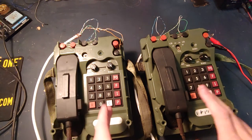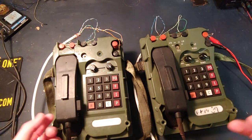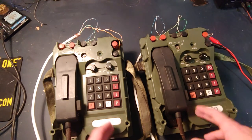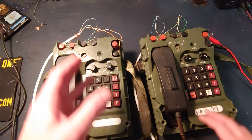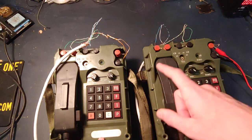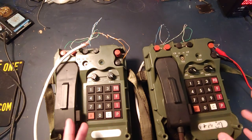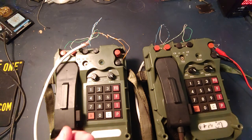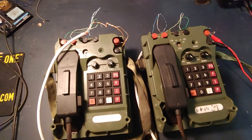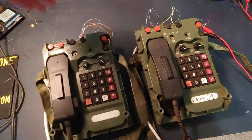These phones will go up to 1,000 feet, which is their normal or maximum range. On eBay they have spools of wire that run about 1,000 feet — that's actually what these were designed for. I would much rather use Ethernet because it gives me a 4-pair and I can use a pair for 12-volt DC. At 1,000 feet, I don't think a DC power supply would travel that far on Ethernet, so I would probably need my remote phone on a separate battery. But it's completely doable. If somebody wants to hook this up in a barn or an off-site room, a 12-volt DC power supply running off 110 AC will be perfect for it. It's very primitive technology, but generally advanced at the same time.